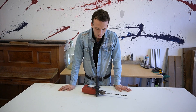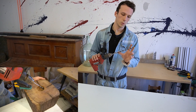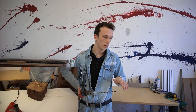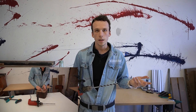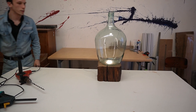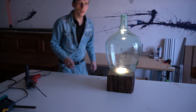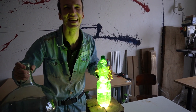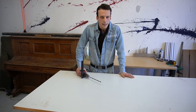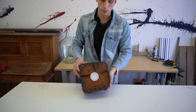We're back a couple of days later — unfortunately our microphone said goodbye, so we can only show the material. I drilled a hole with an 8mm drill bit, long enough to go through the whole wood beam, and then fed the LED lighting cable through it. Now I want to show you the result. You can see how proud I am in these shots after the project — and I also want to show how simple it is to make art with a little plastic bottle placed on the LED lighting. It still looks beautiful. I've sanded the edges and oiled the top.